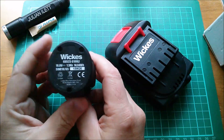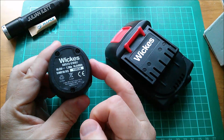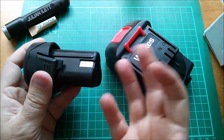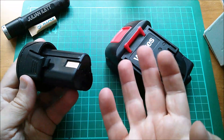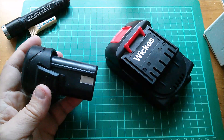They were also selling these 10.8-volt 3-cell batteries for just one pound each. I've taken that one apart already and have a video of the insides. It has cell protection on a cell level, so if any cell goes below or above voltage, it shuts off the charge and/or discharge MOSFETs. Let's take a look at what's inside the 18-volt pack.